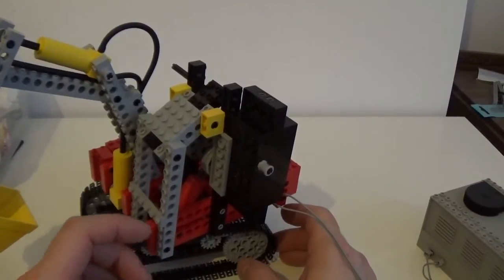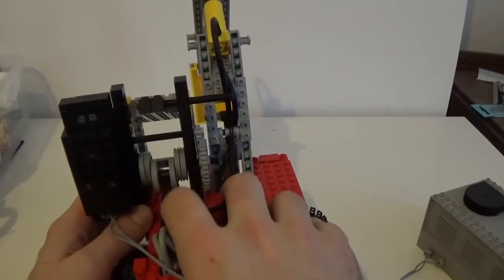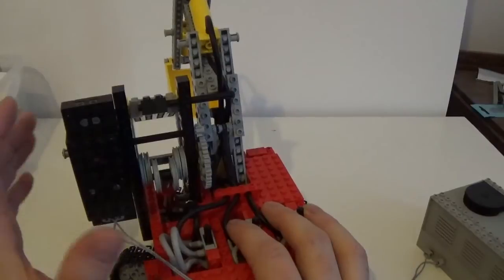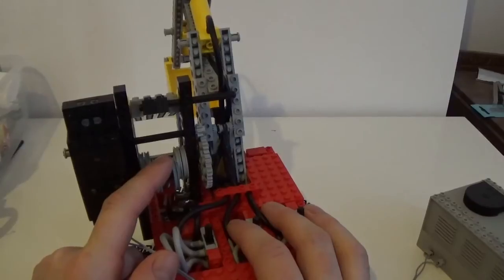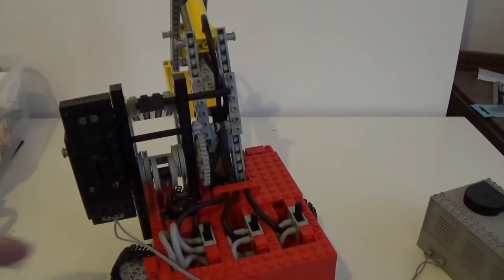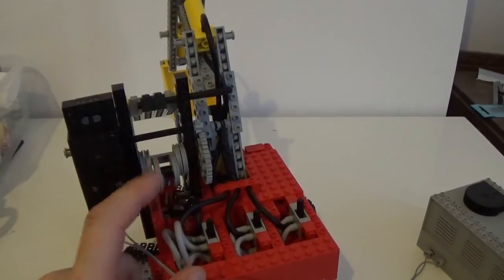So I had to rearrange the system a bit here, using different gears and rearranging the position of the axles, in order to make sure that the range of motion was wider. Now, once I did that, I had to face a second problem, which was that this little motor doesn't have enough torque to overcome the resistance, the friction that this piston has once it's pushed